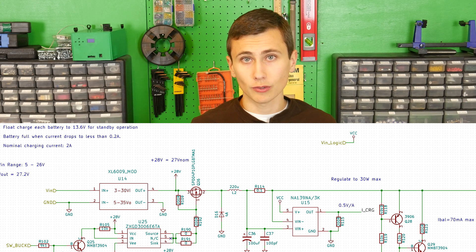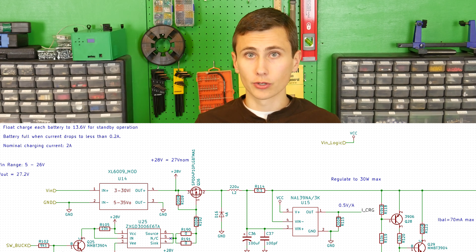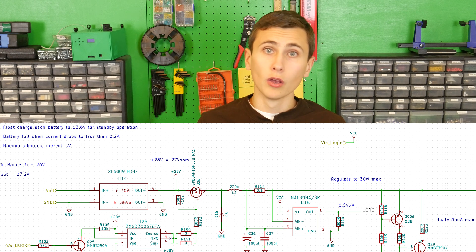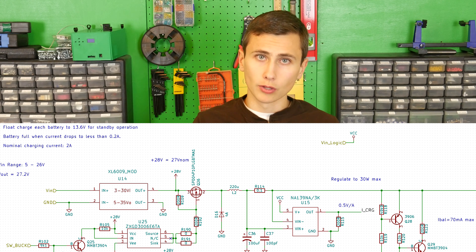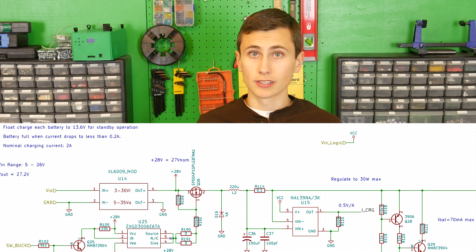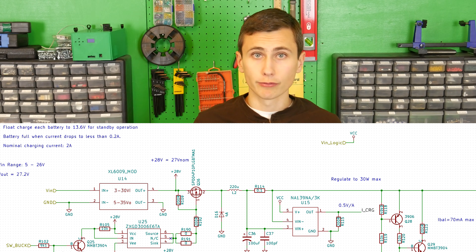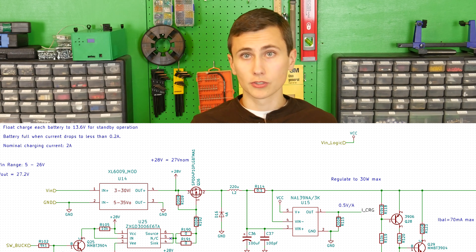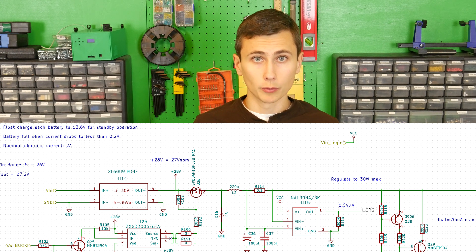The charging current would be limited to 1.11 amps, but instead we follow the 30 watt limit to put out the maximum current possible up to 2 amps. However, once we reach our voltage set point, the control system will begin to regulate voltage and flow charge up to the final voltage until the current cutoff is reached. At this point, the charging and cell balancing circuitry is disconnected and the batteries are left floating. This floating state is maintained until the battery self-discharges below our hysteresis voltage or the backup is used to ride through a power outage — then rinse and repeat.